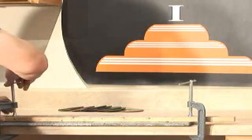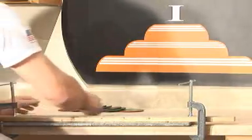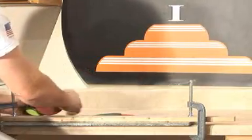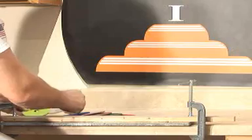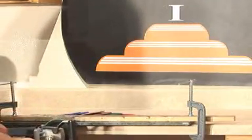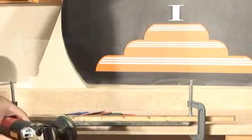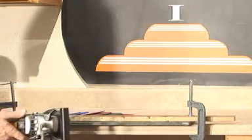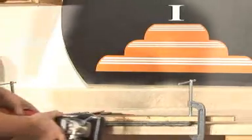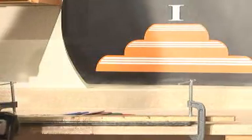Once the C-clamps are attached, you are ready to begin polishing. Lay out your polishing pads in order. We will be attaching the 50 grit to the wet polisher first. Adjust the water till it dribbles as shown. Turn on the grinder and begin polishing from left to right. The important thing with the 50 grit is to remove all saw marks and imperfections from the face of the tile.